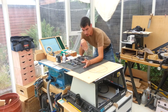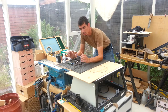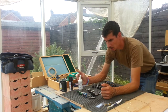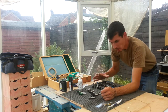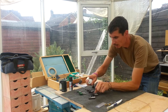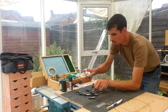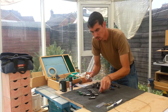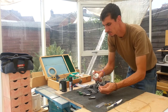I'm going to clean my collets and cutters. I'll show you how to clean the cutters, things to consider, and how you basically prolong the life of them. I've separated them out: straight cutters or cutters with no bearings, cutters with bearings, and then the collets. The reason I've done that is because I'm going to use a solvent to spray onto the cutters to get in there and start eating away — give them a bit of a pre-soak to remove any resin, dust, and grime. I don't want to get it in the bearings because that will mess with the workings of those bearings. So I'm going to leave those to soak for a little while and come back to them.